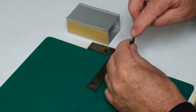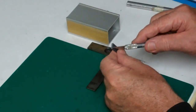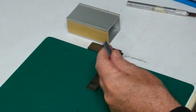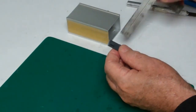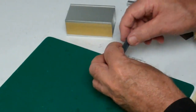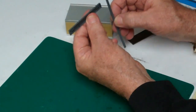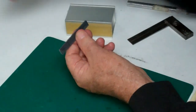and you can see the gray end here all the way across, which means it has completely been sanded. Then I'll just take the blade and I just wipe it across the corners. Takes that little fuzz off the corners, and across the end here, just a swipe. You get a nice clean corner, and just a double check. Perfect. Again, this black, looking at it through the edge here against the white paper, and it's a nice square cut, because what's important is when the legs, I'll just use a piece of scrap here, when that side leg goes on there, it's got to be absolutely perpendicular. So that when that's bonded, it's very important that that be square. That's simple.